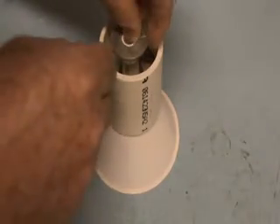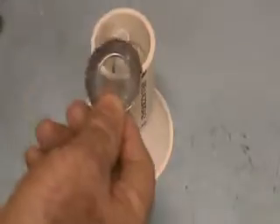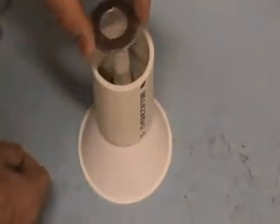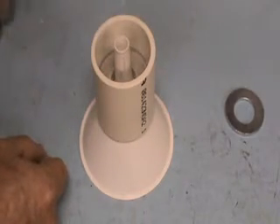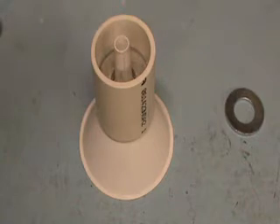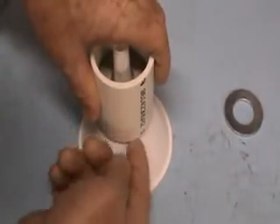Once that cools for a few minutes, you take a seven eighths SAE washer and place it on the funnel. Sometimes I just take a smaller piece of PVC and set it down there to kind of square it — you can tell if it's crooked. Once you get the washer on there, you pour Rocktite until it covers the washer by about an eighth of an inch or so, and you let that set for about 15 to 30 minutes. Then you take a knife and break it loose from the funnel.